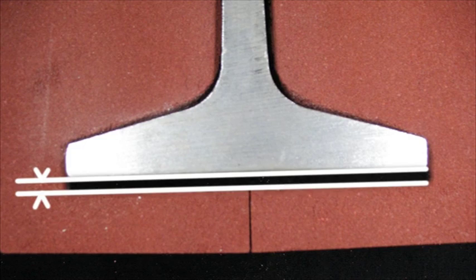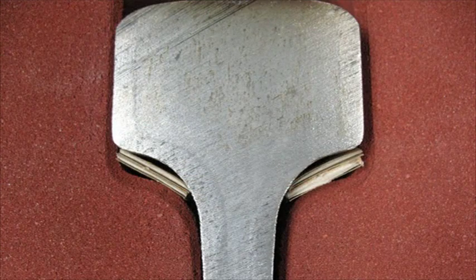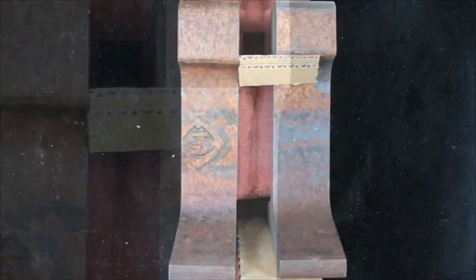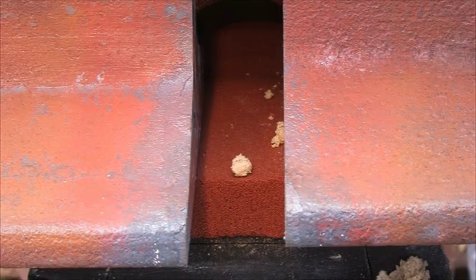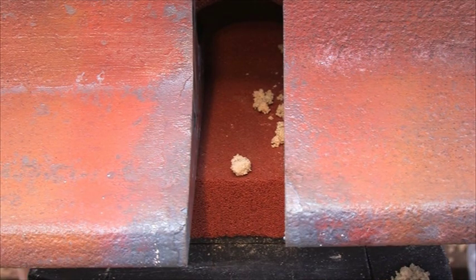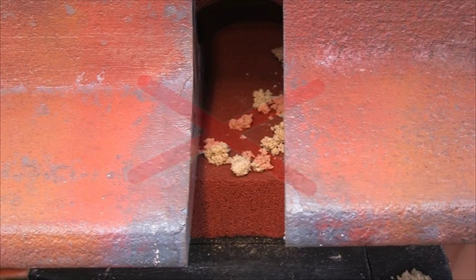These spaces must be filled with cardboards, while the cardboard's caulking mustn't project beyond the mould surface. As you already know, the principle from luting at the railhead here, the luting sand is also to be pushed against, and this way to create the compact sand barrier for the liquid steel. Without these cardboards, the sand would unacceptably be pushed through the space inside the moulds, and would result in sand inclusions in the weld.